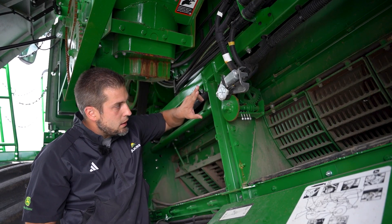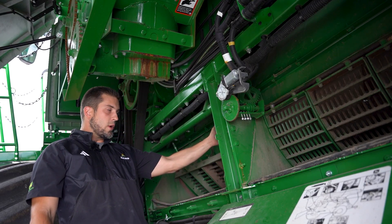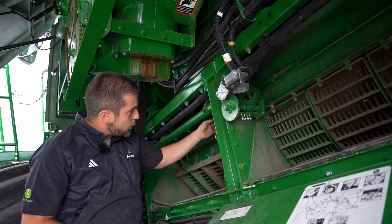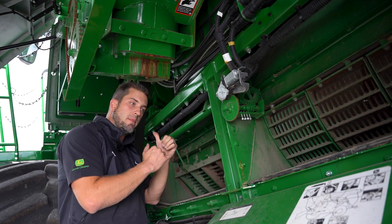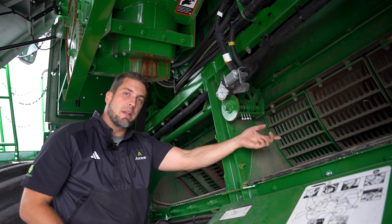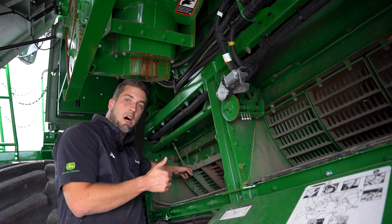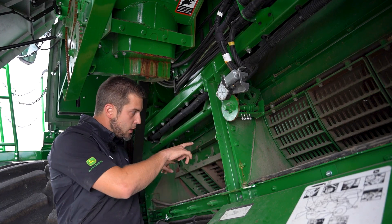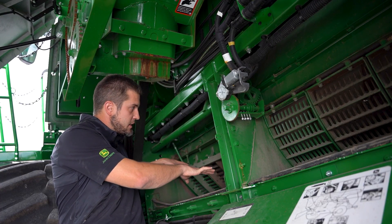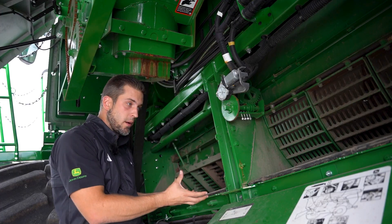I'm making sure I'm checking all 360 degrees of clearance. Once I'm able to do that with this set at zero, I'm checking my gap at the rear where this rod is and at the front. I will do either a half or a full turn at a time, getting it tighter and tighter in the front and the rear as I'm spinning the rotor.